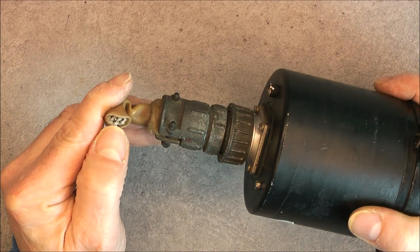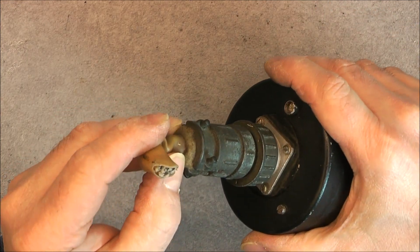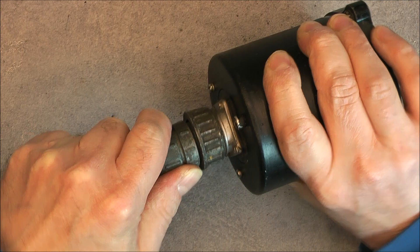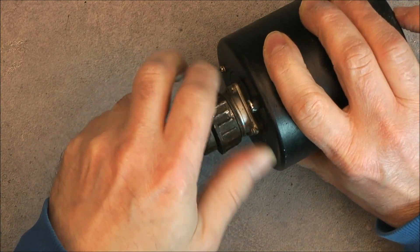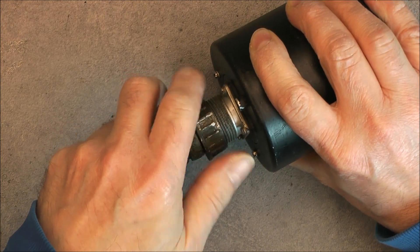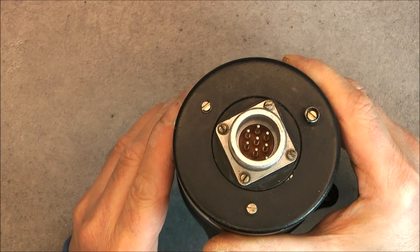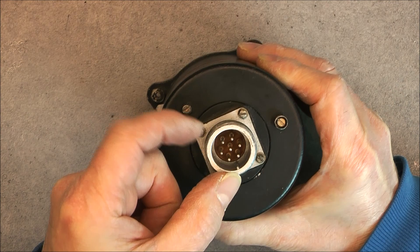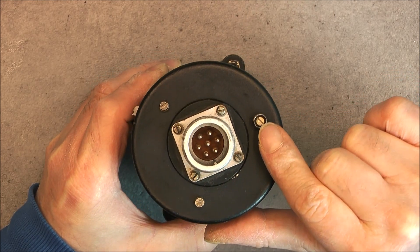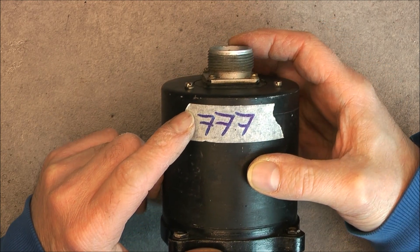It came with a connector and cut wire harness with cloth sleeve cables, and a clamp to secure the cable in place — a regular Soviet kind of connector. To remove it, you unscrew a little bit, then pull and wiggle until it comes off. By doing so you will not damage the screw thread or the pins, which seem to be silver coated and very thick. The case on this connector is quite serious — three slotted screws to secure the case and one factory seal, which is not there anymore. This piece of masking tape with my inventory number I added myself.